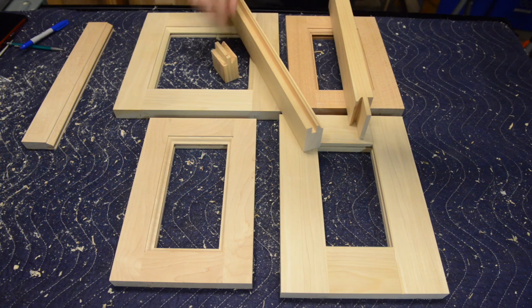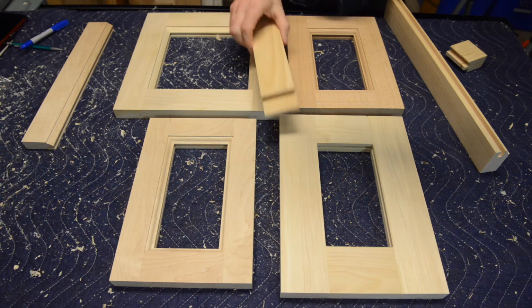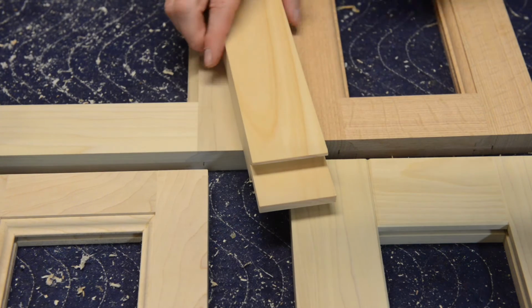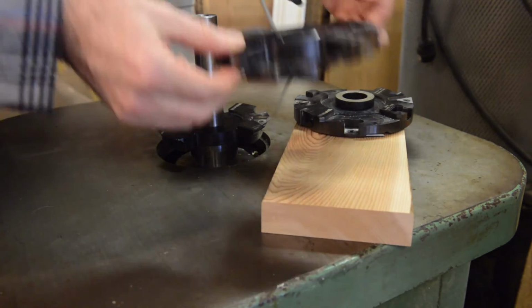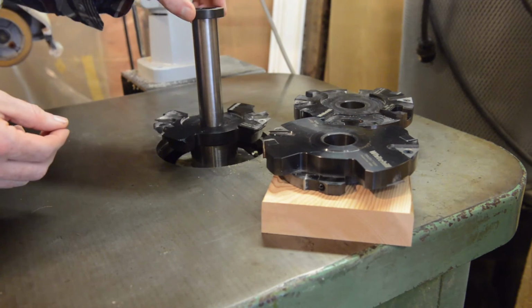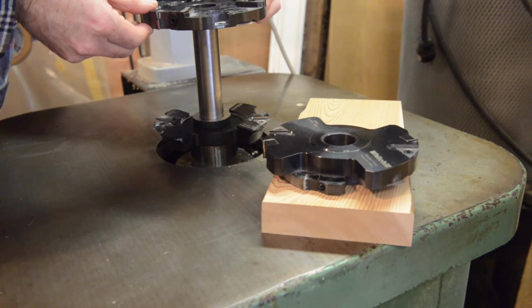Now, as for the tenon itself, substituting the stock component that normally machines the back half of the joint and the stub tenon to length with a component from the mission set, shimming as required, permits tenons up to about 43 millimeters long.